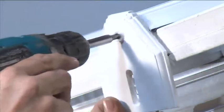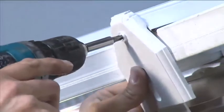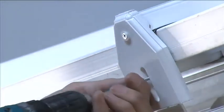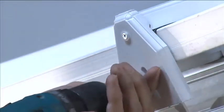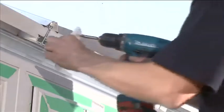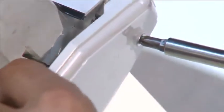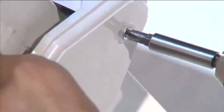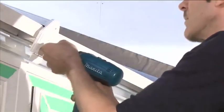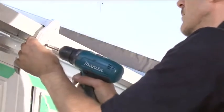When the glazing bar top caps are attached, you need to close the end of the glazing bar with the glazing bar end cap. The glazing bar end cap is attached to the glazing bar by two 3.9 by 19 mm yellow screws. Sit the lip of the end cap over the top cap and locate the top screw through one of the plastic washers supplied and into the port in the glazing bar. Use the hole in the end cap that aligns with the bottom screw port to locate the second screw. Ensure that the screw cover caps supplied are used to hide the screws once in position.